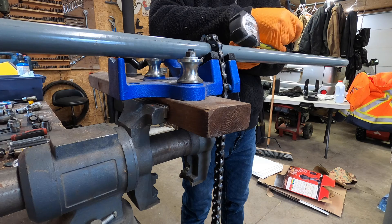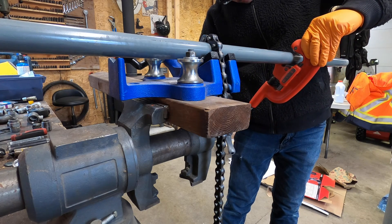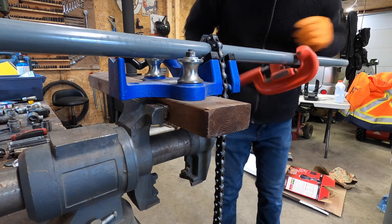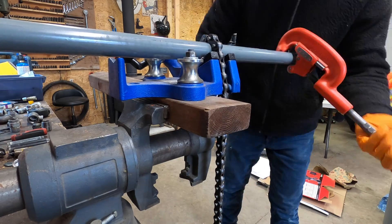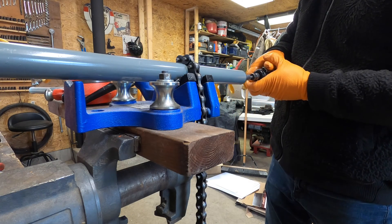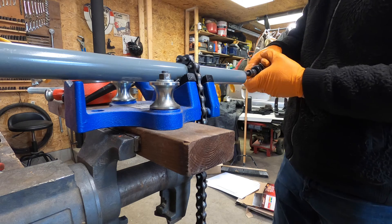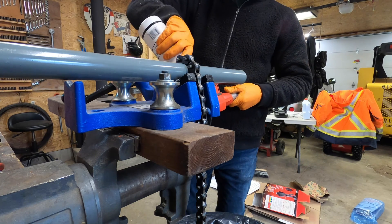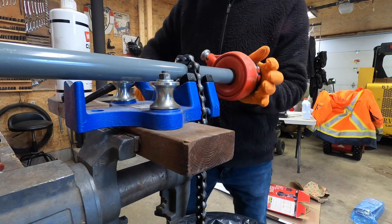Okay, we're just measuring up some pipe here for the outside. I pre-paint a lot of the pipe that's going to be on the outside — it just makes it easier for finishing later on. Sometimes it's difficult to paint the pipe once it's close to the wall and around obstructions and things like that. So that there was just reaming out the inside of the pipe, so that you reestablish the proper inside diameter of the actual pipe itself. There's a special tool for reaming it, but I didn't have it with me in the shop, so this burr does the exact same job.